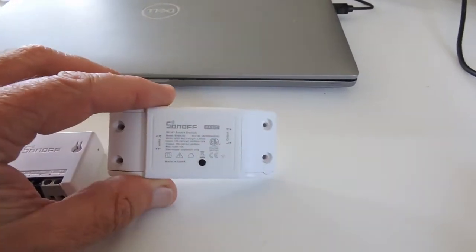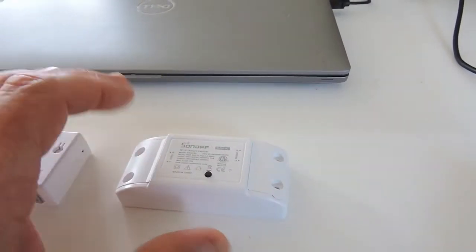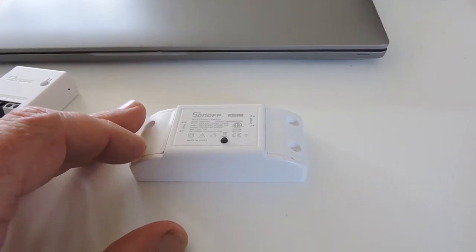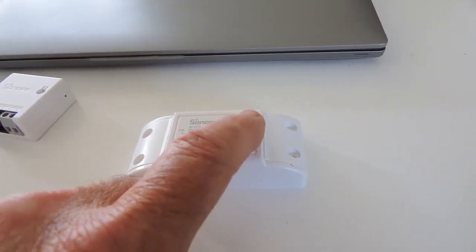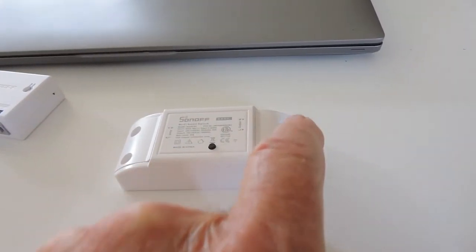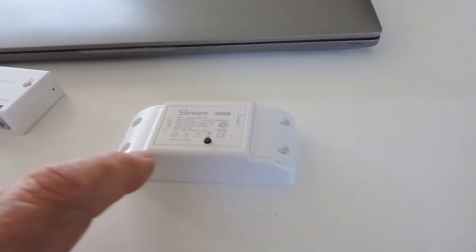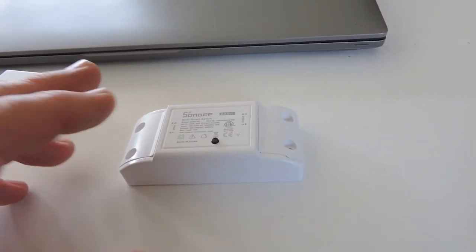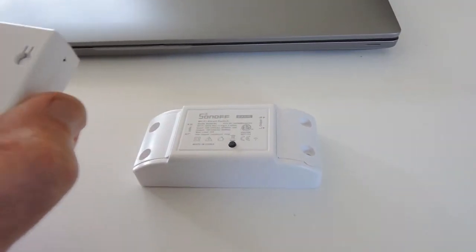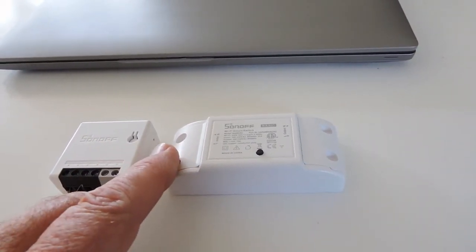The Sonoff's main market is automated switching, in which case you need mains on either side — 220 volts or 110 — on either side. But for other projects, you can quite easily, by cutting a track inside the device on the board, isolate the relay from the main supply, giving you a dry contact on the other side. I would advise you to mark it clearly on the device in case anybody gets electrocuted. Very handy devices and very cost effective. You can do that in both of these models. I've put a link down in the description to someone that's done a good job of this already.